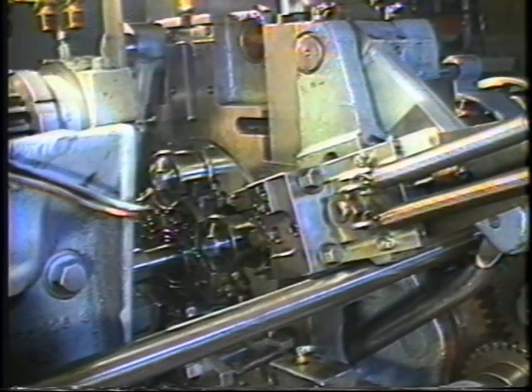Beginning in May 1990, the 1644 SA third position slide became standard equipment on the Davenport screw machine. The lower section of the slide is adjustable laterally one half inch.